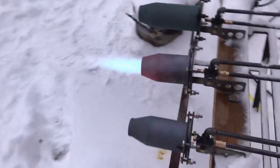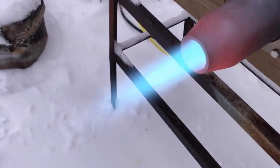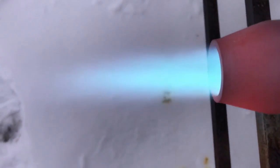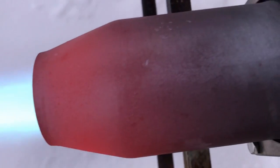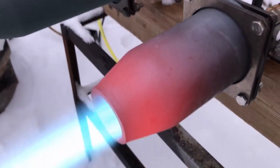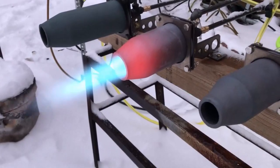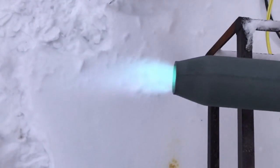This will make this combustor glow red hot, which also radiates thermal IR energy, and that is a lot better at spreading out the heat than just a hot drafty fireball. Because if your firebox has too much secondary draft, it can actually cool things down — we don't want that. That reminds me: I want you guys to close up those bottom draft holes that you have.